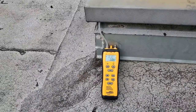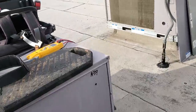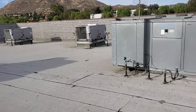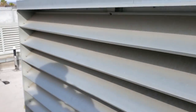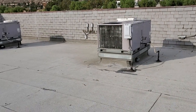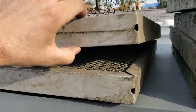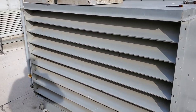I went ahead and pulled all the air filters out of the units — they were all dirty, but it really didn't make much difference. I'm noticing several ACs where the indoor blower motors aren't running. Also, I walked over to the makeup air unit and the filters are plugged solid. I'm going to pull those filters out too, and then jump on the ACs to check which ones weren't working. These filters are plugged and several of them are really thin and deteriorated. We'll get them all new filters and leave the old ones out for now.